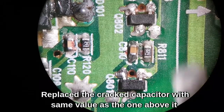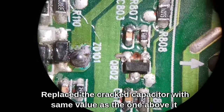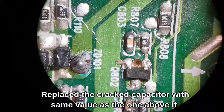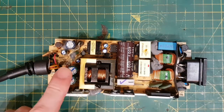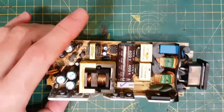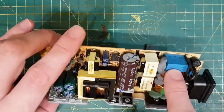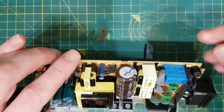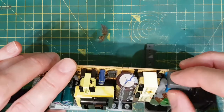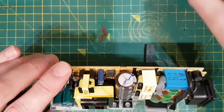Now I've replaced this capacitor — that was the correct one, 10 nF. So that's the power supply back together. I checked all these caps on my Gizmo — they're fine. I've checked all of these MOSFETs on my Gizmo — they're fine. I checked the bridge rectifier — that's fine. I did change this capacitor: it's supposed to be 0.47 microfarads, a filter on the input. I found this in a drawer — it's about half good; the original was less than half good, so I've switched it out.